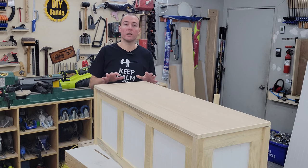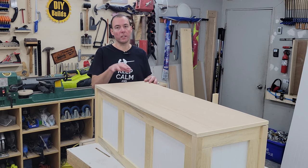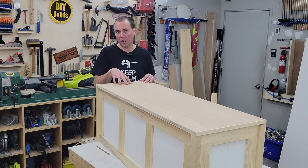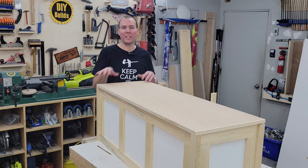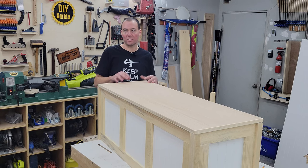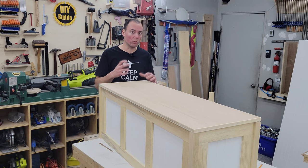That really is a soft close. The next thing I'm going to do is take off the lid — I'll leave the hinges on the lid, take them off the box — take off the soft close to get it out of the way, and we're going to add some foam on top and then our cloth. I'm going to attach all that with some half inch crown staples. You really want to use the crown staples as with just a regular staple gun it really doesn't have that holding power.